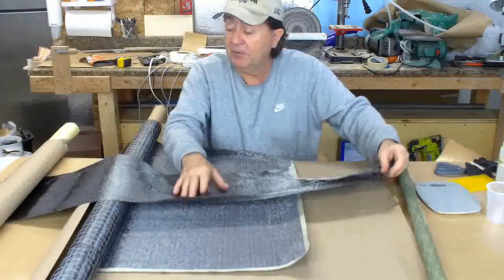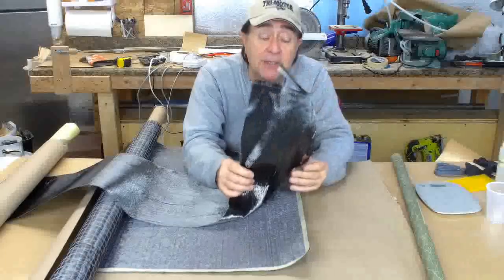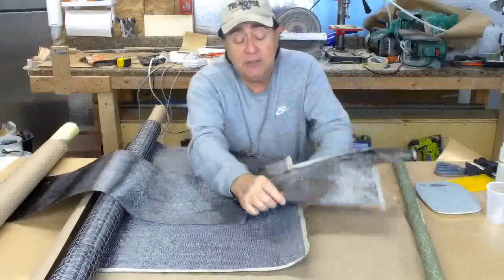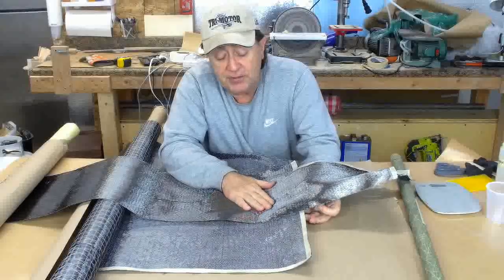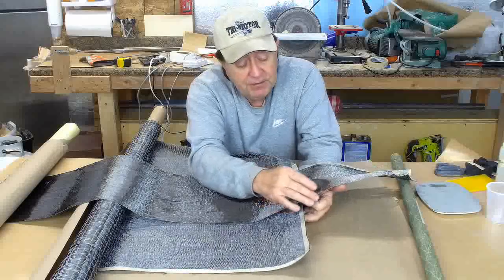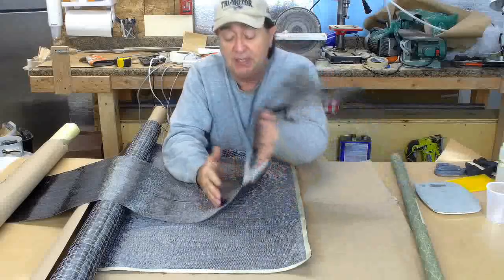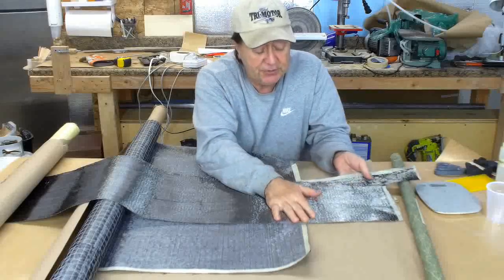Now, this is the carbon fiber I've used in the past for making the tubes. This carbon fiber comes from TAP Plastics. This carbon fiber came from Aircraft Spruce and Specialty. And look at the difference here. There's almost no scrim in the TAP Plastics unidirectional carbon fiber. Very fine fibers, I feel, at the edge here, and it's interwoven in between. It's not just glued on the outside. In fact, on neither side can you really see that scrim that's holding it together.